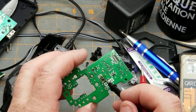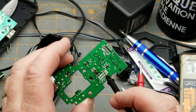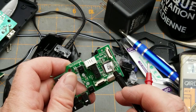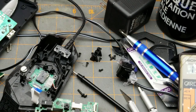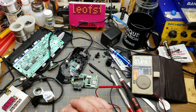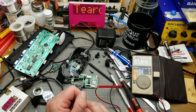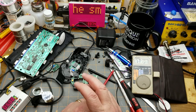Even if I could find what this five-pin component is - I'm assuming it's a 3.3-volt low-dropout regulator - and replace it, it already smacked the STM32 microcontroller. And even if we could get a replacement STM32, we can't get the original firmware, so we're toast. It's a waste of effort to go any deeper. That was an interesting exploration though. Since I'm the one who brought this KVM into the house and gave it to my kid, I guess I owe him a new mouse. Live and learn - thanks for watching everybody, hopefully next time with something a little happier than dead electronics I can't fix.